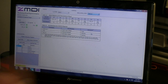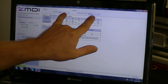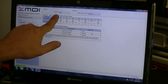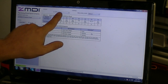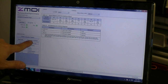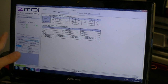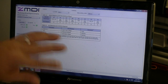Default was 1.5 amps and I will leave it right there. So those are the only two settings you can master on this, especially the voltage. Especially if you have a 2.5 volt cap instead of a 2.7, you will end up overcharging it with the default settings. Once we're done and we've made our settings, right down here it says write config to EEPROM. Click that — it doesn't give you any confirmation. So just pull up read config again quickly and make sure the settings are still the same. Everything is done.